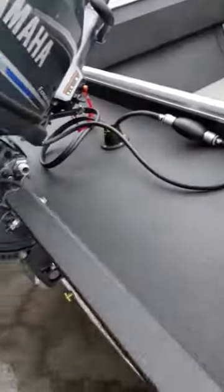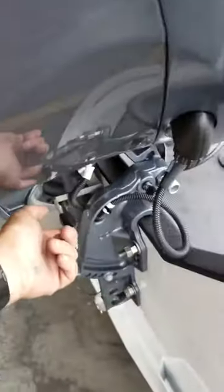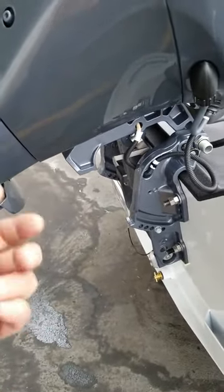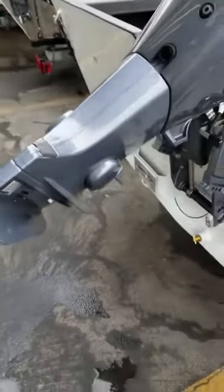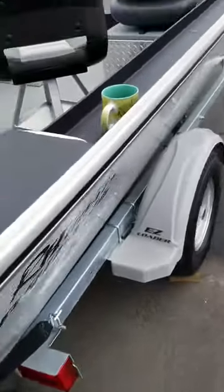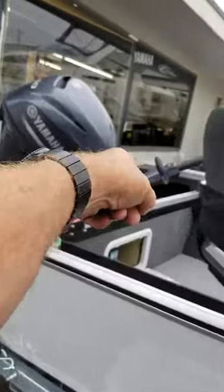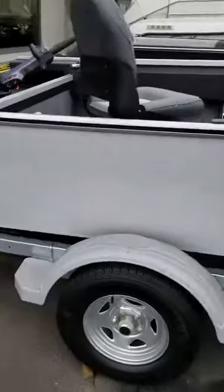There's your other slider there. This is what they call hydraulic assist — these are really easy, just lift up on that and they drop down. If you want to get them up, sometimes you give a little gas, lift that up, then pull it up and kill the motor after you get it to come up. I'll tell you about that 10-degree hold — you got a delta pad out back. You got a nice little reverse there; that's what keeps it stable and pops it up on top. There's your key switch right there. That little red button's your stop, and that's your safety lanyard, and that is plumbed into that tank. This is your Boat Doctor, getting ready to take it to the water right now.